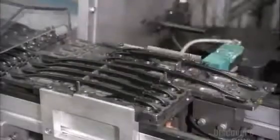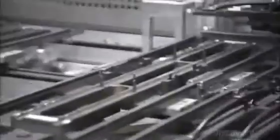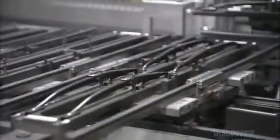First, it sets a plastic joint on the smallest brackets, then clips them two at a time onto a larger middle bracket. Next, the machine sets an adapter onto the top center bracket so the wiper can attach to a variety of car wiper arms. Finally, all the trays on which lie the assembled wiper parts come together as the machine proceeds with a final assembly.